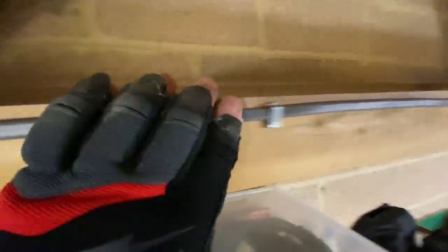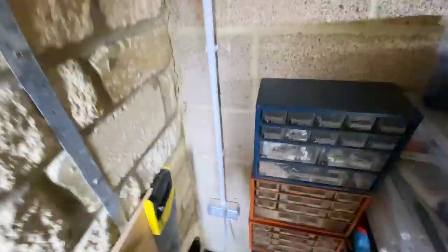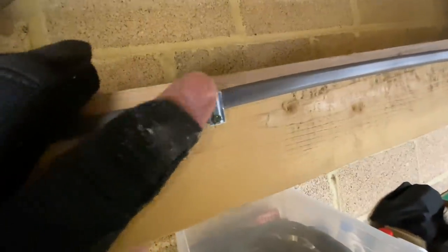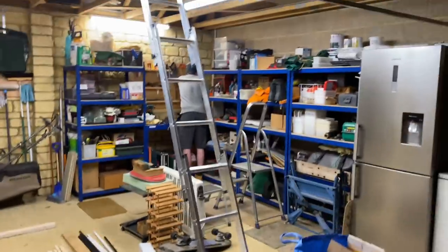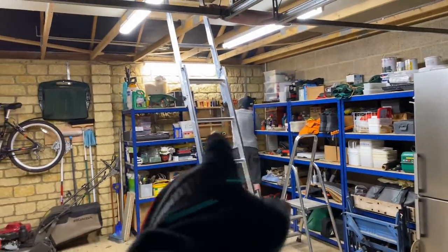We're wiring this radial - it's a midpoint radial, that's the second socket, first one's over there. We've clipped them in and put some metal fixings into the wood - it's something isn't it. Then running this across the top of the rafters. I have to go along here and here - supported every 500mm so it's better than nothing.